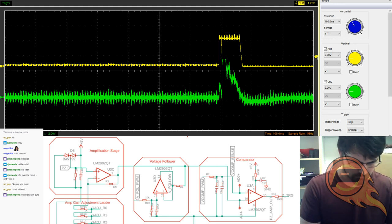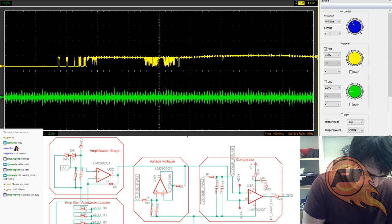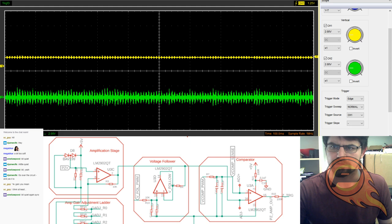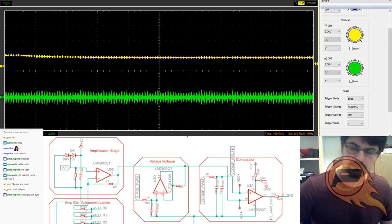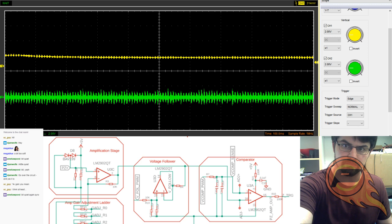I'm going to go and stick that probe onto the comparator output, and we'll see the rise time. We need to do a falling edge. And just set over. Okay, we can get trigger here, but let's try normal for a second. My direction's wrong.